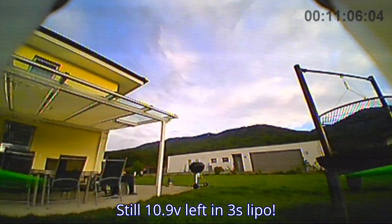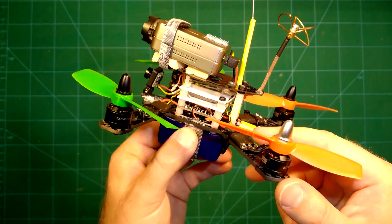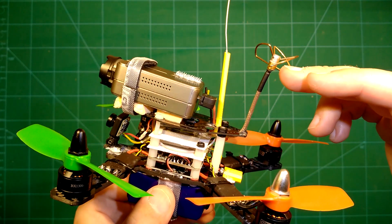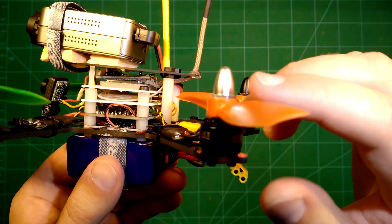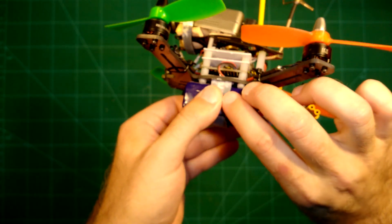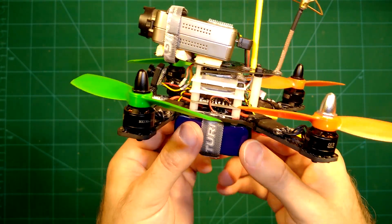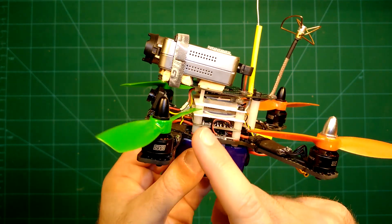Which is pretty amazing for such a small quadcopter — it's just what I wanted. Here you can see the little Grasshopper in full ready-to-rumble configuration. You can see the Runcam 2 on top without any battery, the cloverleaf antenna installed with the video transmitter, and the little motors with the 4045 bullnose props which works really well. On the bottom I have the little 850 mAh 3S LiPo. It has quite a low center of gravity and everything is quite centered with regards to gravity as well.